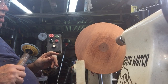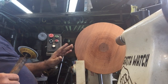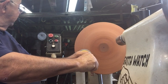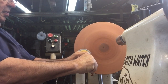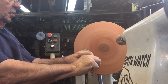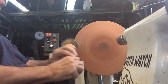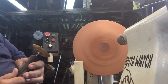I sanded a disc with what looks like 320 earlier, but I'd rather start with 80 grit. The speed is about 200 RPM — does that make a big difference? Absolutely not. I'm cutting with the little corner of the pad, moving it back and forth so I don't leave ridges — I'm taking ridges out.